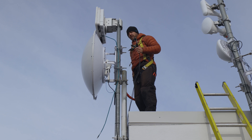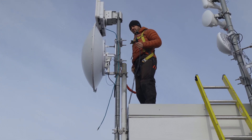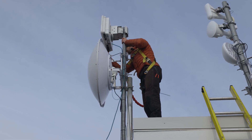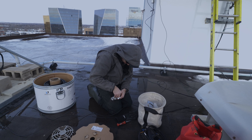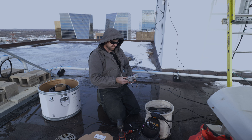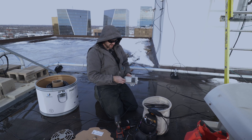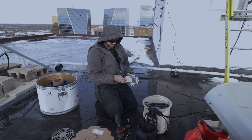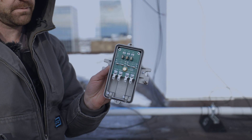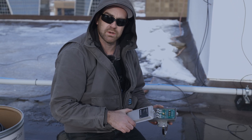I think these radios are very airtight. When I pop this off, there's pressure — super weird. This is a grounding box for handing off the DC power. The main power source comes in one side — it's a DC surge protector with fuses. So if there are any spikes in power, it'll protect the radio and pop this before it gets to the radio.